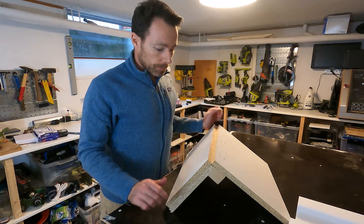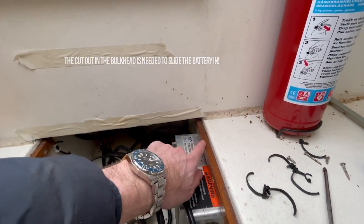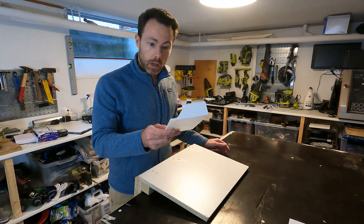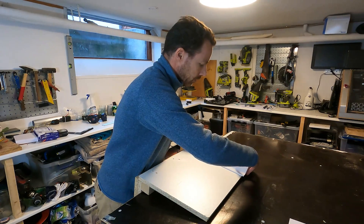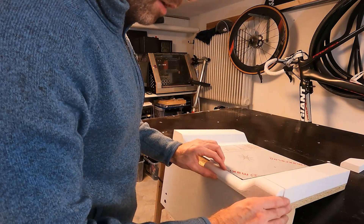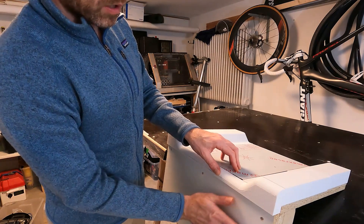I start building the mold. It's going to be an L-shaped cover — on the fore side there's a little hump to give clearance for the battery, and then it has the L-shape going up to the main bulkhead where the companionway doors are. I made an L-shaped base mold, and with the help of my 3D printer I printed some parts to give the hump shape. There are pieces placed here, here, and on the end face these pieces form the corner of the L, so the finished part wraps up to the bulkhead of the boat.